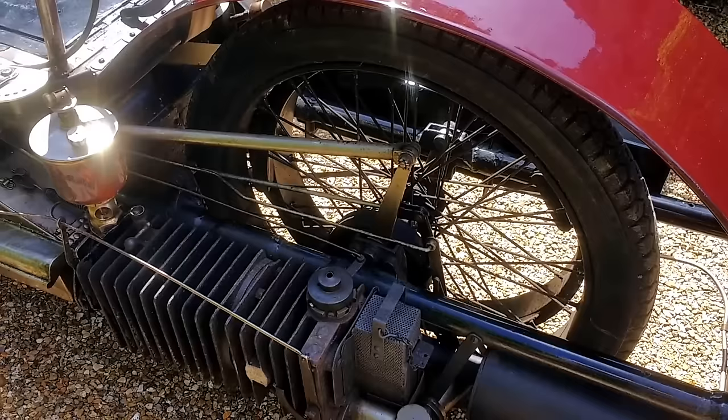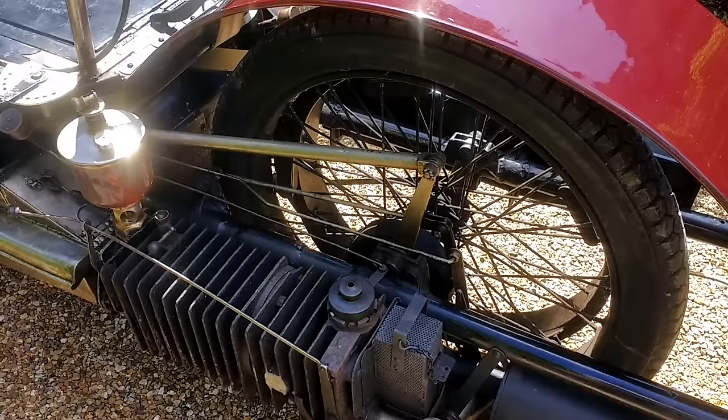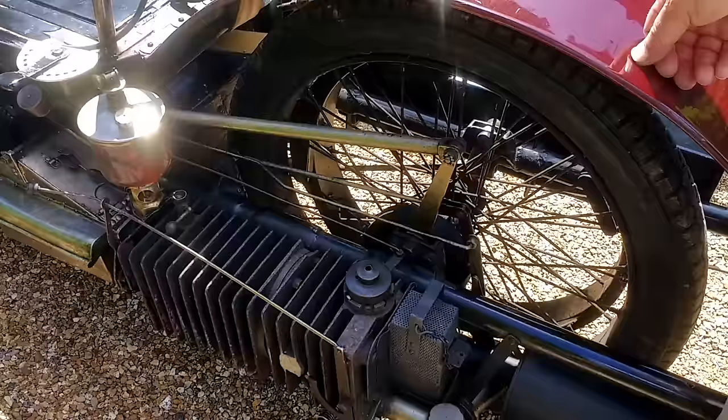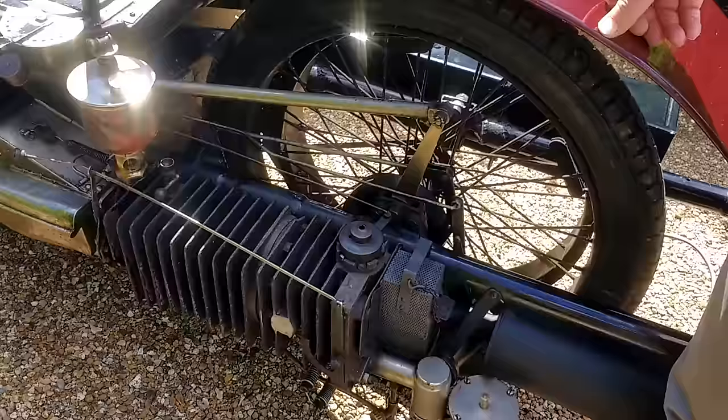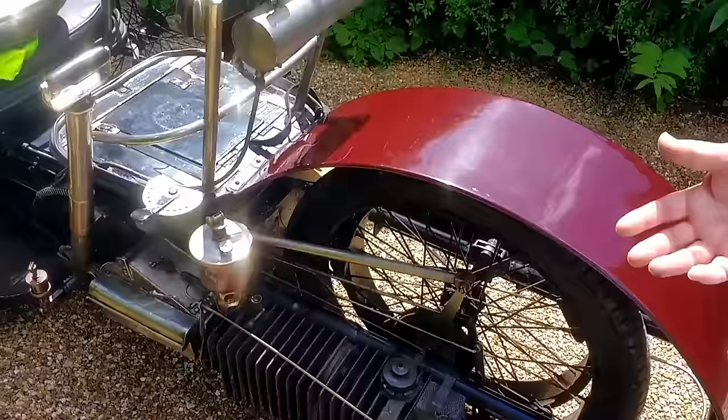The main thing is to get it started. So is that running all the time, the gas heating that? Yes. And if the flame goes out, then you stop. Originally, the burner would have been of a different type and would have been fuelled by a special spirit, similar to petrol but a pure version — a special boiling point spirit they use, SBP2. Petrol tends to block up the jets in the burner, whereas the SBP2 doesn't.